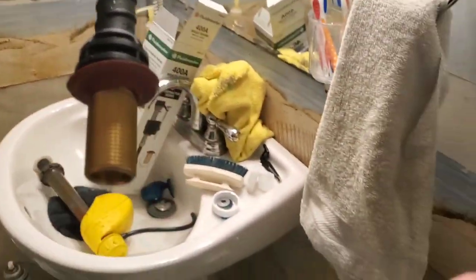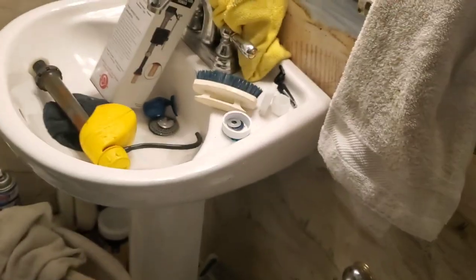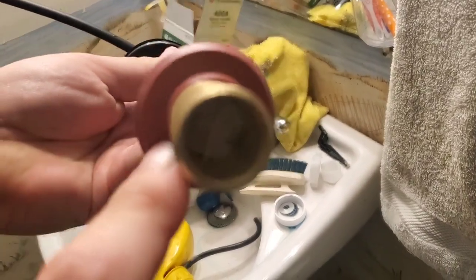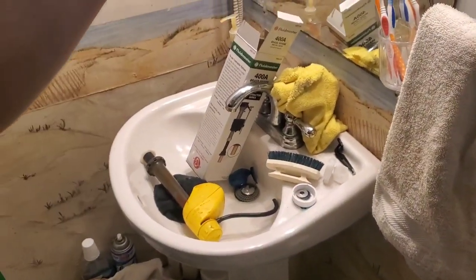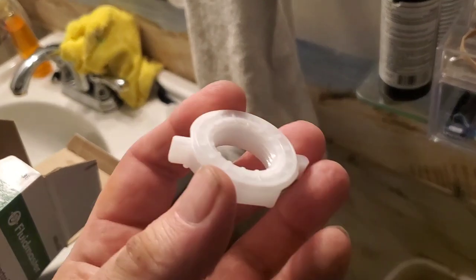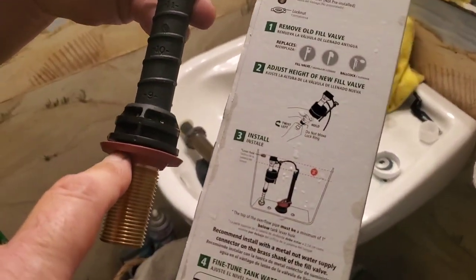The gasket for the lower part — this red gasket right here — had a little center punch-out. You had to punch this out first, and then that gives you access to slide the gasket all the way up over the brass with the beveled side facing downward. That's going to go through the hole and seal it up nice and tight when you put the lock nut on the bottom, causing a nice tight seal on the bottom of the tank.